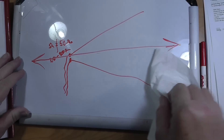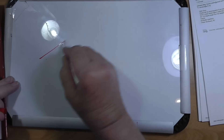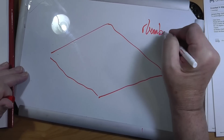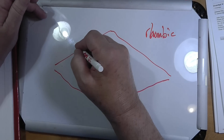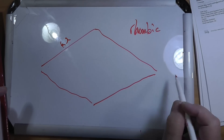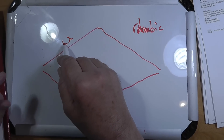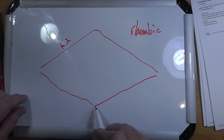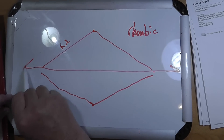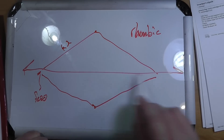Now, this brings us to the obvious: what happens if you treat this like a folded dipole and bring it back on itself, like this? This is a rhombic antenna — R-H-O-M-B-I-C. Again, this is multiple wavelengths long; K is some constant greater than about 2 or 3, and K doesn't have to be an integer — it could be 2.5 or 3.75 or whatever. These wires are connected here, and it gives you almost the same radiation pattern in both directions. You feed it here and leave the other end open, giving you a very strong bidirectional pattern.